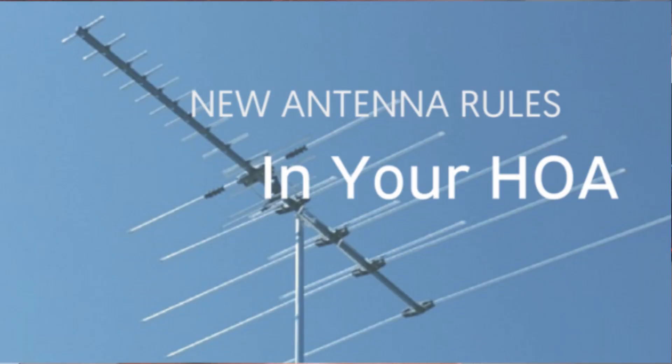One thing I want to address is homeowners associations. A lot of people complain their HOA doesn't allow an external antenna on their house. I don't have an HOA so I put up whatever antennas I want, but one thing you can do is put an attic antenna in. This gives you the highest point in your house with the least obstruction — no copper piping for the signal to reflect off. I set one up in my dad's house and it performs very well; he can hit a repeater 30 miles away with his attic antenna.